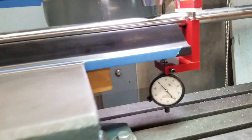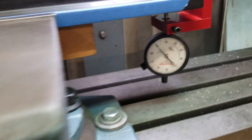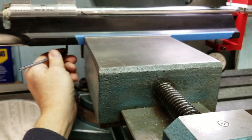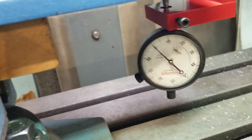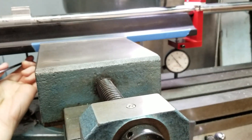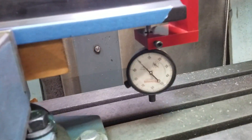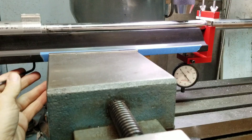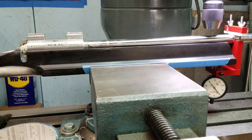I release it — it's loose — and I snug it back up, she's tight. We started out at 25 inch-pounds and it's giving me 25 inch-pounds again. Loose, tight — loose, tight. There you have it: I think we have a zero stress, successful bedding job.